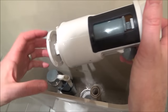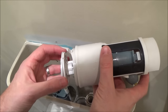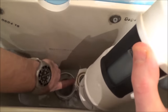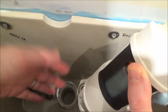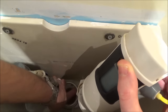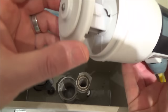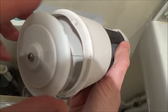This is the thing that's causing the problem. Every time I flush, this goes up and lets the water rush past it, but it's not dropping back down — it's staying in the up position so water constantly rushes past. I have to press the button again for it to drop back down and seal against the bottom. First of all, rub your hand around here to make sure there's no debris blocking it — some plaster or limescale might have broken off. On my toilet it was really gushing through, but if you've just got a trickle it could be debris, or it could be this little rubber seal here, which might be damaged. You can easily replace that by undoing the screw.